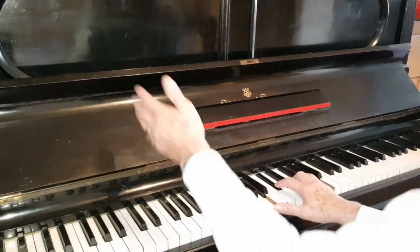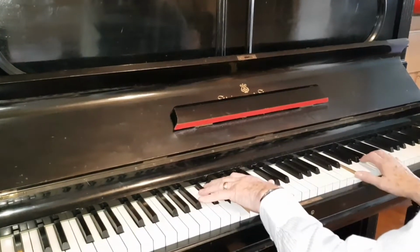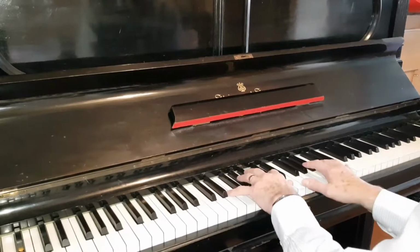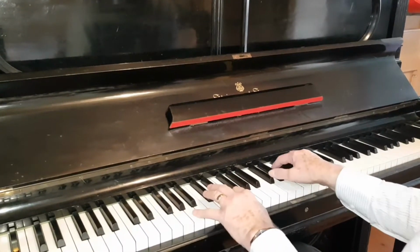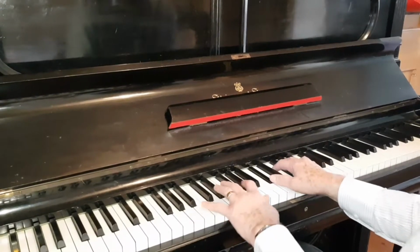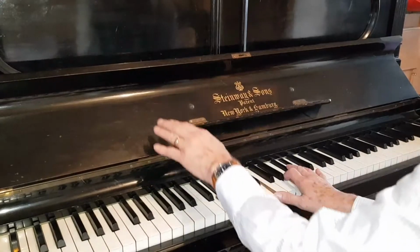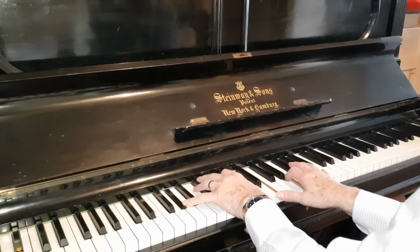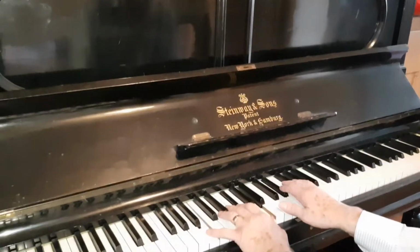The casework is an issue, obviously. We don't do black French polishing. We do lots of rosewood French polishing. It takes about 60 hours on an upright. Black takes longer, unfortunately, because it shows up every single defect. You can disguise in a way with rosewood, or as was the most common one we would do. And rosewood comes out beautifully as well.